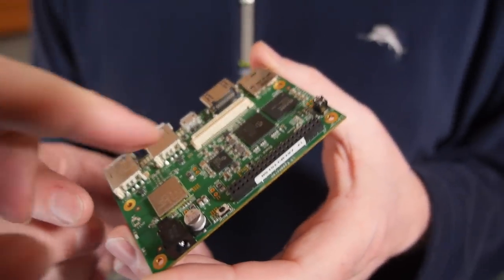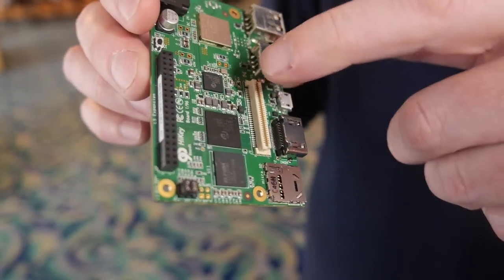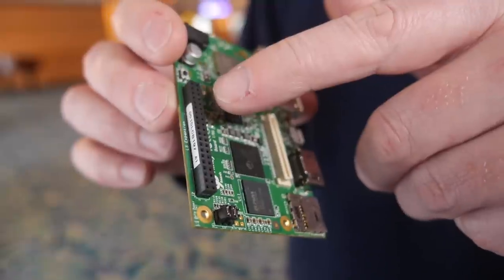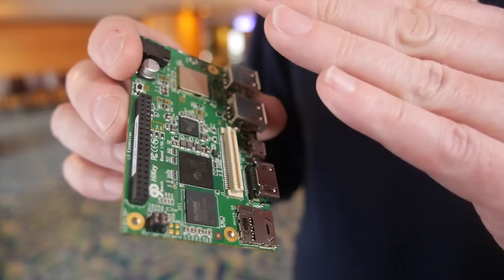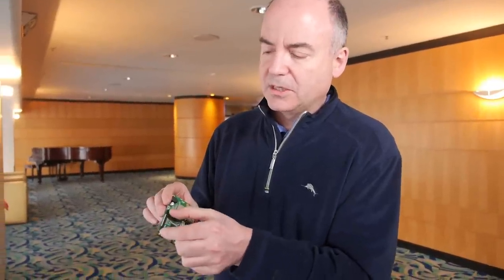There's something about the UART and the connectors here. You have this high-speed connector with camera and display, and this is the low-speed connector that carries UARTs, GPIOs, SPI buses, I2C buses, and an audio bus. This is actually 1.8 volt IO, which is typical for low-power processors today. For the maker community, which typically uses 3.3 or 5 volt on 0.1-inch centers, we expect to see third parties come up with expansion mezzanine boards that turn this into 3.3 and 5 volt maker-friendly IO, potentially Arduino compatibility, things like Raspberry Pi camera interfaces — all on mezzanine boards that will work on any 96 Boards product.